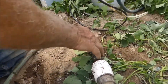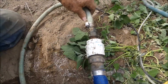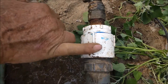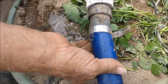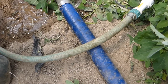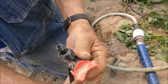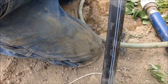We have to adapt that down to an inch-and-a-half feed line. On this adapter, we have to go to a hose adapter, which adapts to an inch plastic adapter, to an inch-and-a-half plastic adapter, and then to an inch-and-a-half male adapter to go into the hose. This inch-and-a-half supply line is an inch-and-a-half lay-flat line, which we use to move our main water around over the field as a supply line. When we get to the point where we want to put it into a drip line — like we have here, which goes the full length of the house — it has little holes every four inches where it drips out.